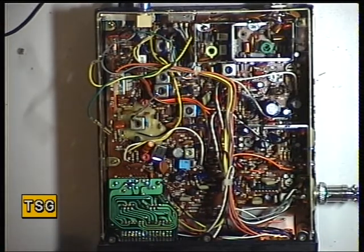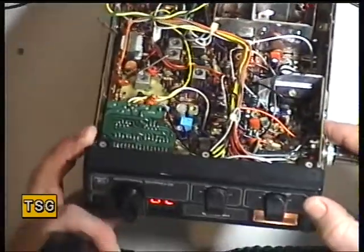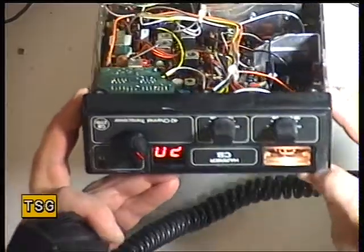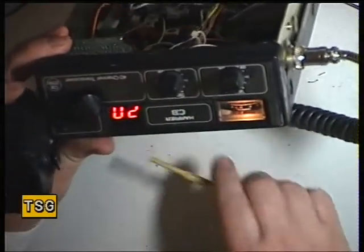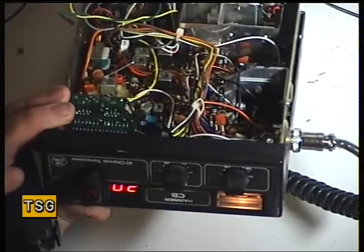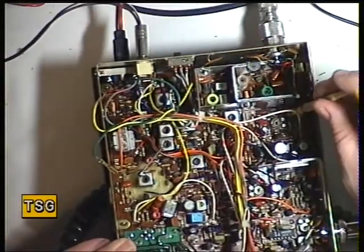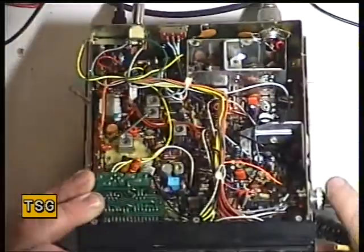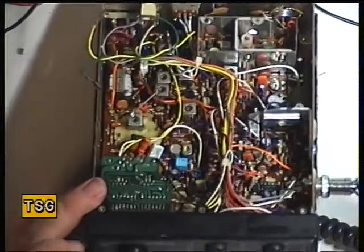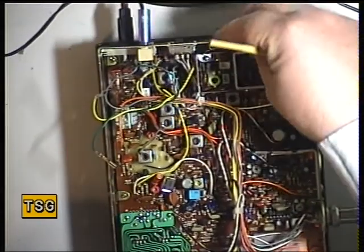Then we reduce it to 4 watts with L9. Obviously a good example — that's brought it up. Next we need to make sure the RF power meter is reading 4 watts. Just realised this front is loose on the set — got some glue on it. Check that the power meter here is reading 4 watts. It's not far out, but we need to adjust it with RV4. That's now 4. Excellent.